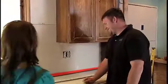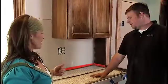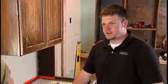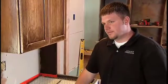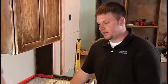Yeah, a lot harder. All right, I think at this point, are we ready to pour the mix? Yep, we got it all ready. And then there's a couple of different kinds of mix that you can use, right? We're using the very budget-friendly version. Yeah, we're using budget-friendly Quikrete 5000 for our concrete, and there's also high professional quality grades of concrete as well. And then do you add anything to that to strengthen it up? Well, we're actually adding about 1 quart of Portland per bag to make it a little more creamy, to make it a little more user-friendly for a countertop situation.